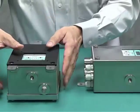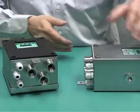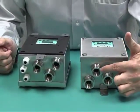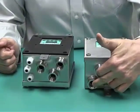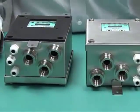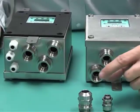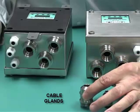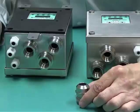The unit also comes with different types of cable glands. Right now we have a half-inch conduit opening for any NEC requirements, but we also offer this with cable glands. They have the option of stainless steel or nickel-plated brass. The cable glands are mostly used for the ATEX and IECEx certifications.